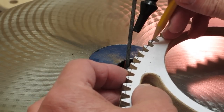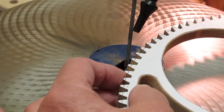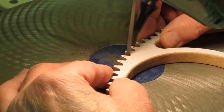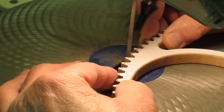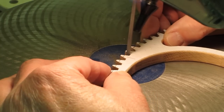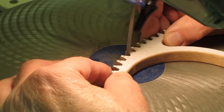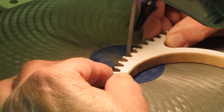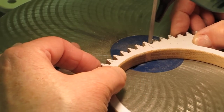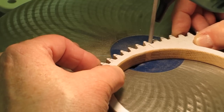The surface of these teeth is quite smooth coming right off the scroll saw, but it will have some variations and ripples, and we're going to eliminate those with this file. Back and forth — keep it moving, don't stop. If you stop you'll end up making another notch in your tooth. Just keep going until the black mark from the pattern just disappears, and go all the way around the wheel. Come back on the other side, work it back and forth, then move on to the next one.